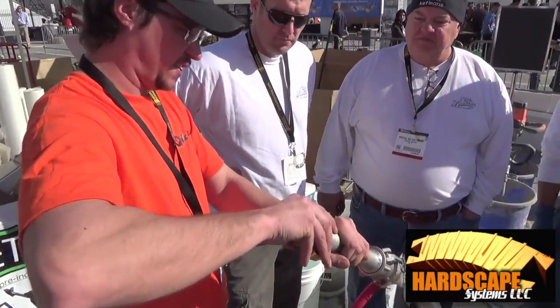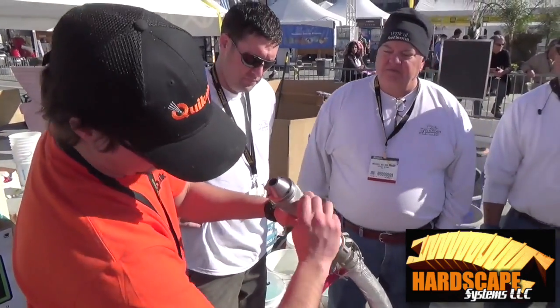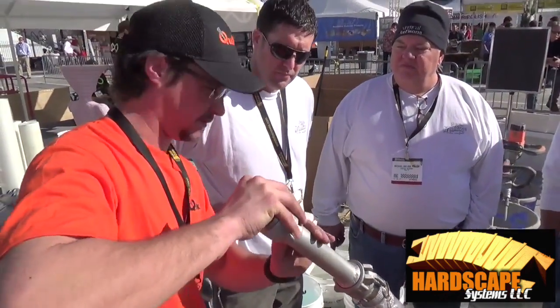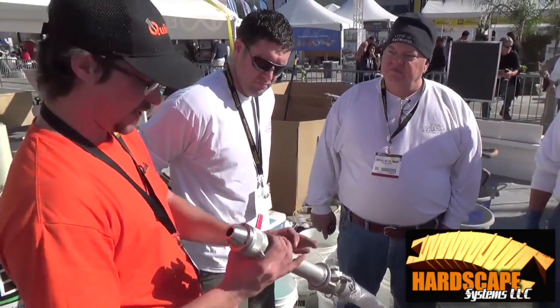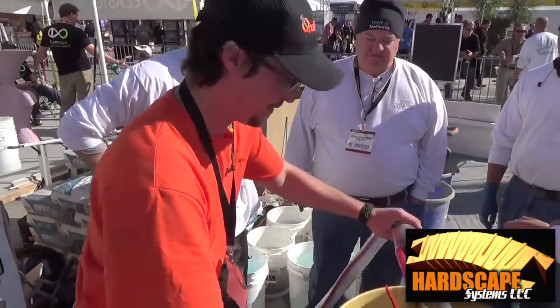It's not like an airless system, like an airless gun, where it just pressurizes. You need the air. Depending on what you're shooting, you just dial in however much air you need. And that's why it's important you have a proper size air compressor. You at least need a 125, because as soon as you hit this thing, it sucks a lot of juice from that air compressor. You can't do it with the Home Depot one. Not with the Home Depot one.